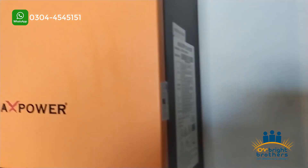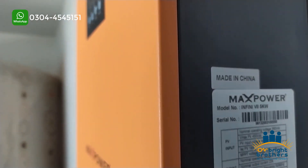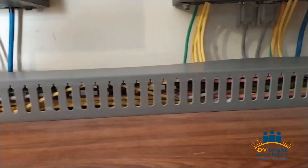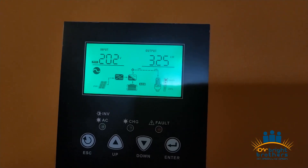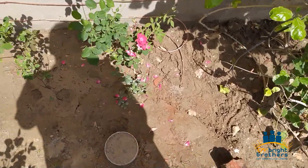We have selected the option so that WAPDA will not charge the batteries — only solar will charge them. The backup can bypass the load, but the batteries will not charge from WAPDA, as we wanted to save the cost of electricity. The customer confirmed this selection is better compared to other options. Looking at the production analysis, we are seeing 3.28 and 3.18 kWh, which is very satisfactory. We have 2 separate DC and AC grounding lines using 16mm copper wire.